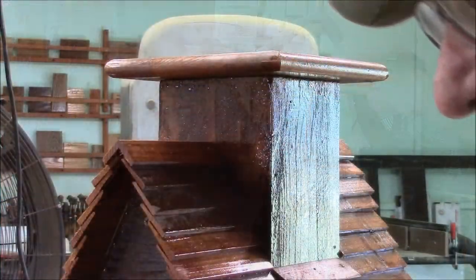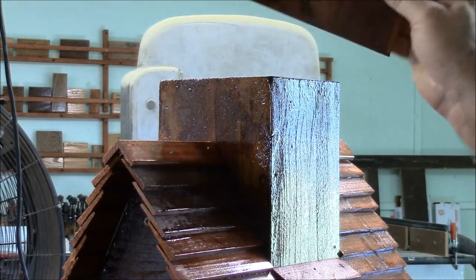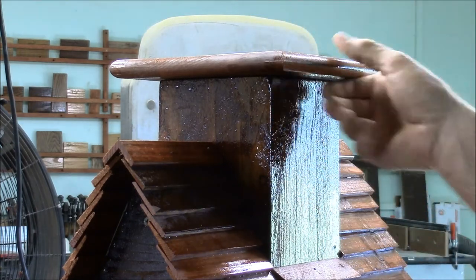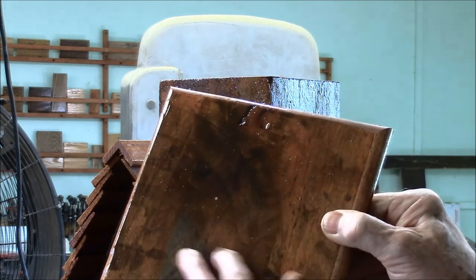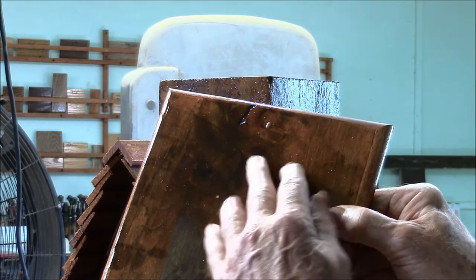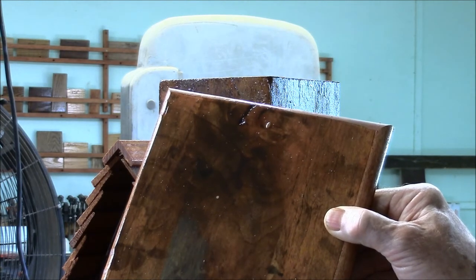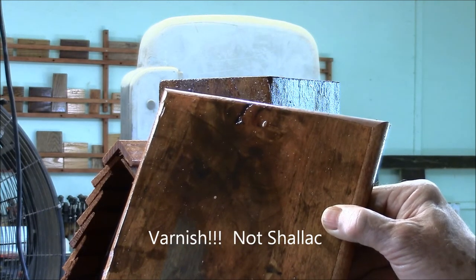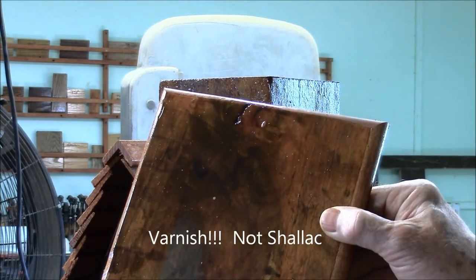I got all the roof shingles on, all the ridge caps, and I built this new topper — it's the lid. It's eight inches square, and the top is covered with epoxy. Over that I put shellac — if the epoxy is sanded, the shellac will stick fine. You've got to put shellac over epoxy because epoxy is degraded by the sun, so you need to put shellac over it for UV protection.